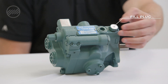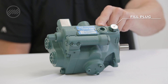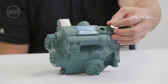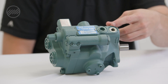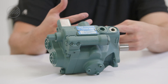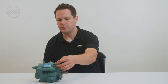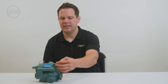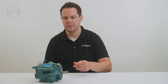We need to fill the case of the pump — this is basically how you prime a piston pump. You can fill through this port if you already have it disconnected before you start your install, or if you've already connected here, you can remove this plug to fill this case. We basically want to completely fill this pump all the way until oil starts coming out the top. When you're getting oil out and you know it's full, that gives your pump a much better chance to prime on startup.